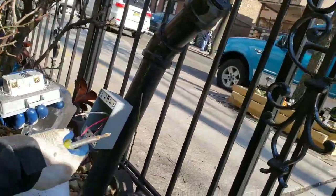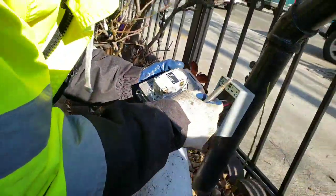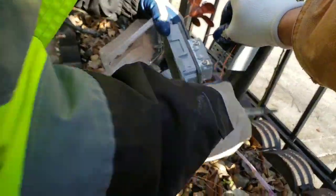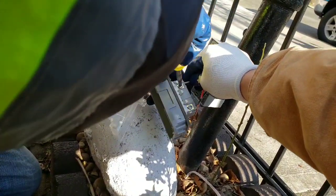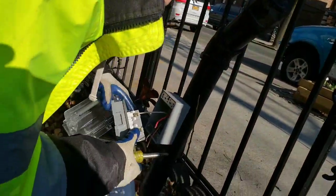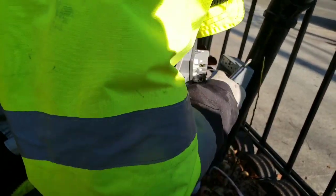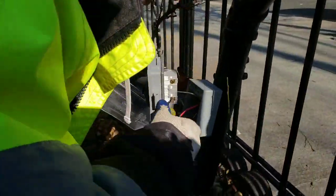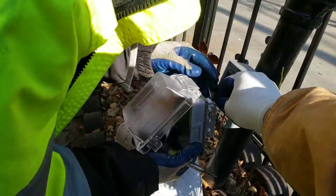Use the black one. We're using the black wire — just going black and white. White goes on this one. You just slide it in there and then tighten it. It's only the GFCI outlets that use it like that — the expensive outlets have it like that. Just tug on it, make sure it's in there. Now he's going to do the black one on the opposite side. Make sure the screw is pushed in. Now there should be a ground block on the top — the green. He's going to put the bare wire on the top because we're using Romex. If it was BX, he wouldn't have to do that. Slide that in there.